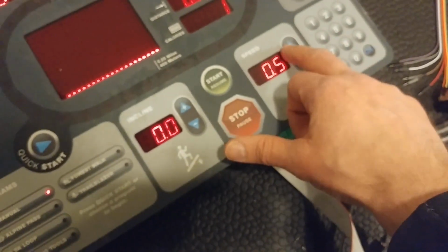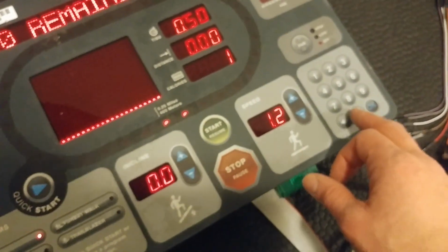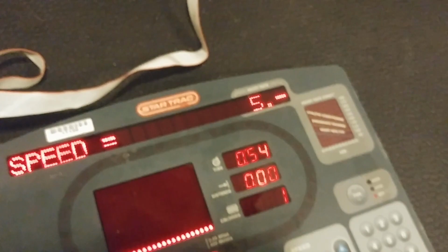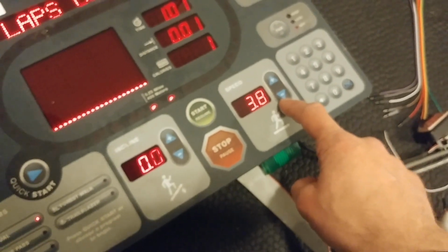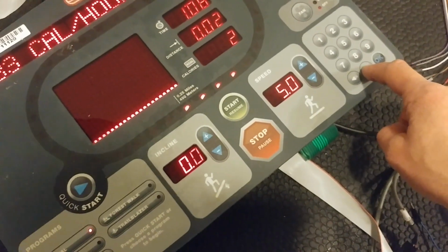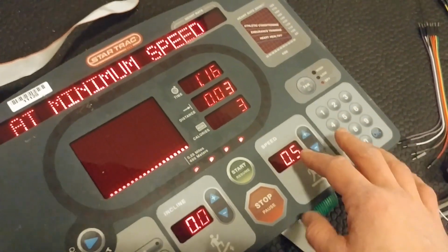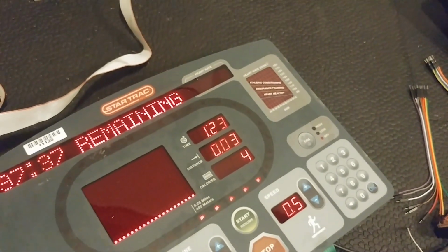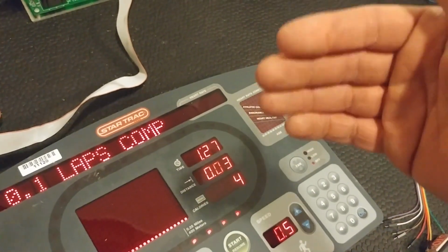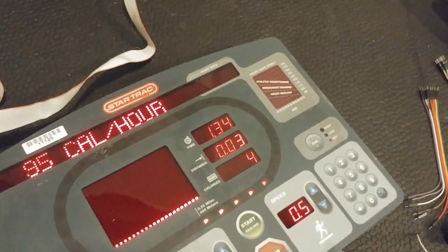Now with the board here, you've got the speed setting up and down, right? And one other important feature I noticed is you can plug in a speed directly. So you say 5 and then hit go. It sets the speed, but then it reads out the current speed. Okay, so something with that speed sensor must also be coming back to the board here. Now, I don't know if there's any extra feedback in that loop, or if this also sends additional controls, but we know that this not only sends a signal for the speed, but it gets a signal back. And what is that? Is that the PWM signal that it uses to control it, or is that the PWM that gets the signal back? Don't really know, but it's at least a thing to watch out for as we continue doing more testing.